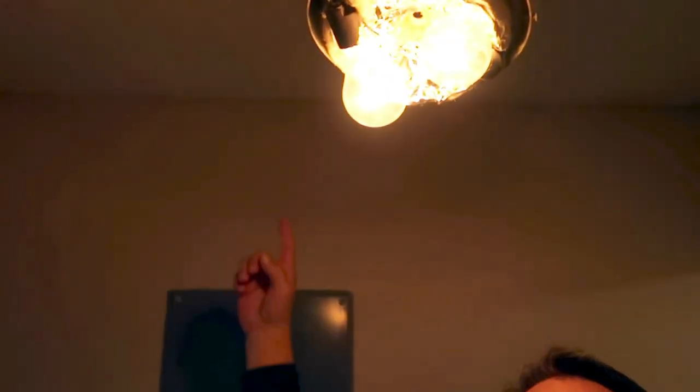I'm going to take you through all the steps to make that happen. It's not going to be an easy process because I've actually got to cut that drywall up there so that I can get a wire up there. There's a 2x4 plate across the ceiling that I'm going to have to drill through so that I can run my wire up there. Once I do that, there's a cavity between the upstairs apartment and this apartment. I'll be able to run a power line across the ceiling, and I may have to cut a hole in that ceiling up there so that I can fish that line without any difficulties.